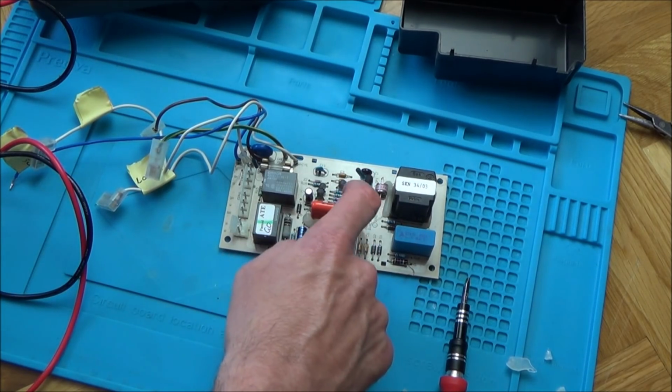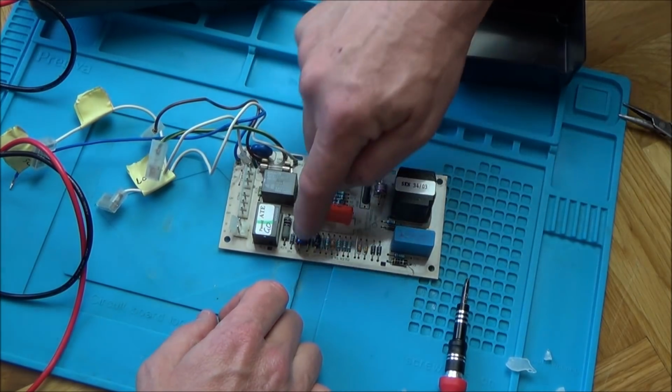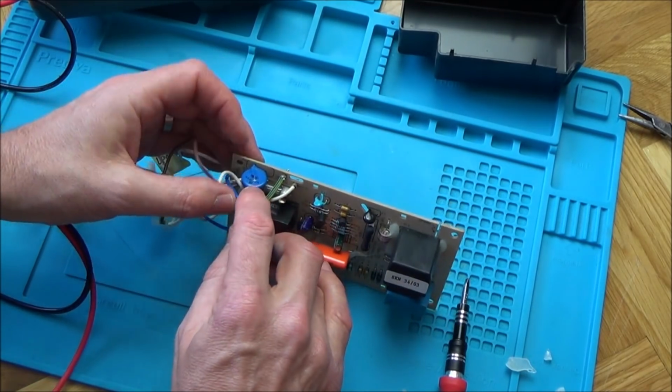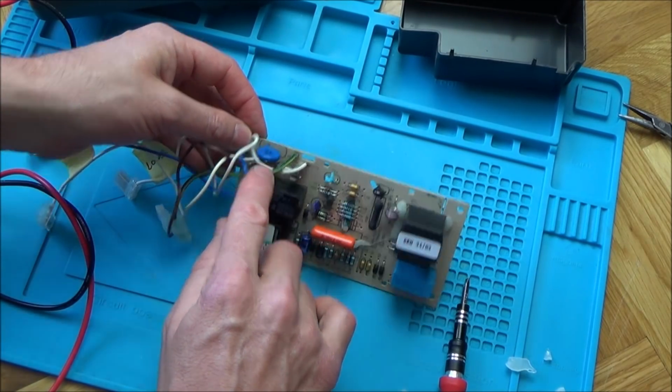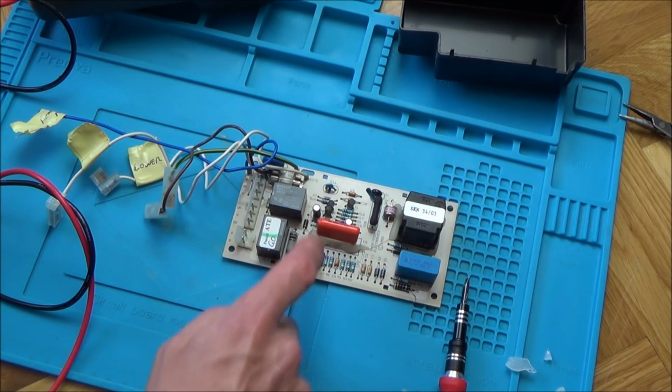No, there's one, three here. Capacitors that apparently give the trouble. I believe they're probably 1, 2, 3 from memory, but the board might be different. I'd have to check. Okay, what's this thing here, Joe? No, it's definitely, there were three, they're called axial, one axial and two radial case.